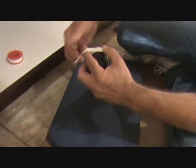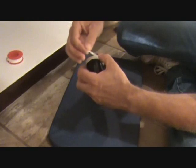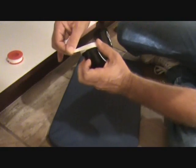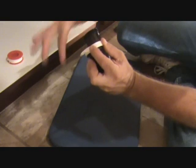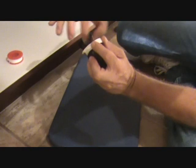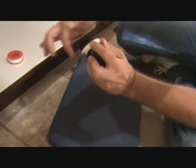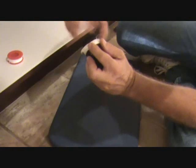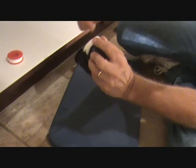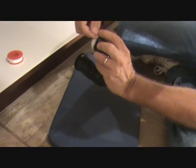The important thing to remember when you put it on is you want to wrap it the same way that you're going to tighten it. So do you see how I'm putting that on? I'm still putting it so the end of the tape is still going this direction. So when I put the nut on, the nut's going this direction, and that's going to help tighten that on. If you put this on backwards, the opposite direction, as you tighten the nut, it's going to loosen up all of your Teflon tape. Hopefully that kind of gives you the idea, and you know what I'm talking about there.